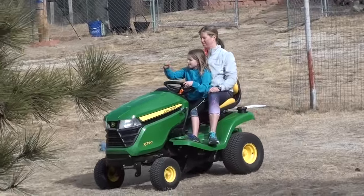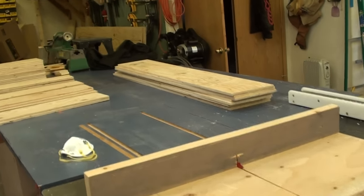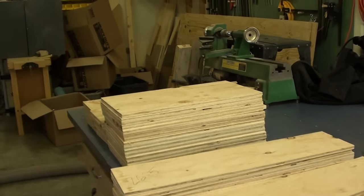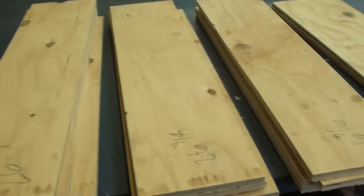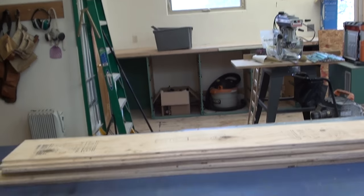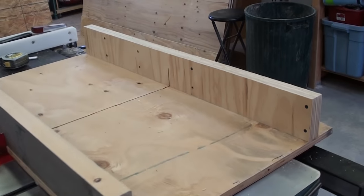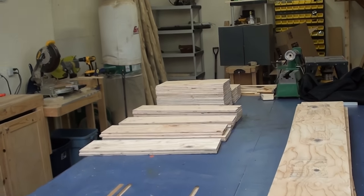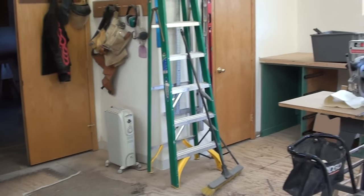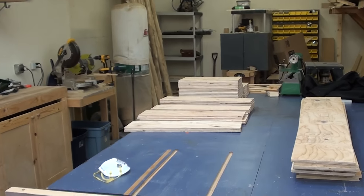While my grandkids are out riding around on the tractor I've been doing work in the shop. Today I got most of my drawer plywood cut down to size - the six-inch drawers, the seven-inch drawers, the nine-and-a-half-inch drawers, and various thicknesses. The partitions weren't exactly perfect but they're about a sixteenth of an inch apart, so if I cut the drawers to allow for that sixteenth they should fit just fine. This is the last segment before I post the video, and then I'll do a dedicated segment just on drawer building. This is James signing off - thank you for watching, for your subscriptions and comments. Come back again - we'll be building drawers for the new bench next.